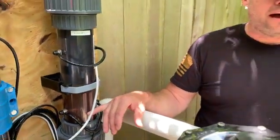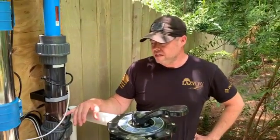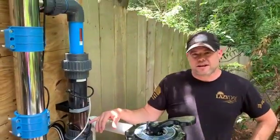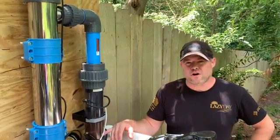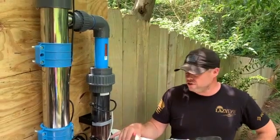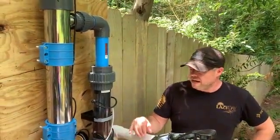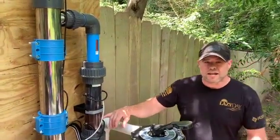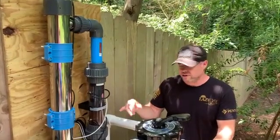The copper bars do wear out — they're like brake pads on your car, they're meant to wear out over time. They're rated for 10,000 hours of use, which for most pools falls within the year-and-a-half to two-and-a-half year range, so roughly every two years you'll need to replace them. Pricing is available on our website or through your certified installer in your local area.